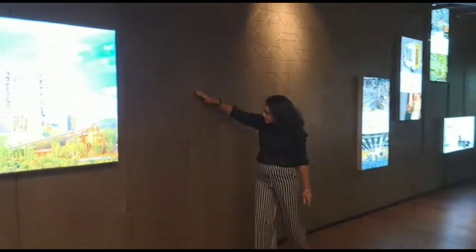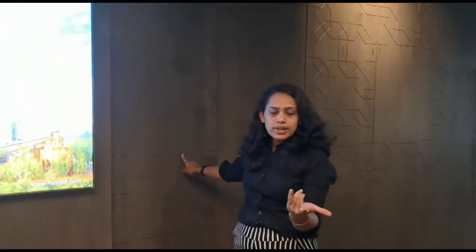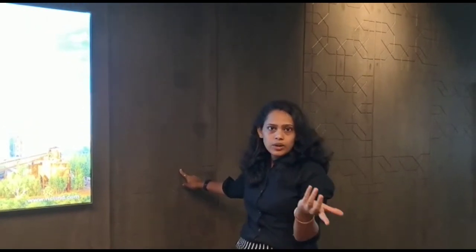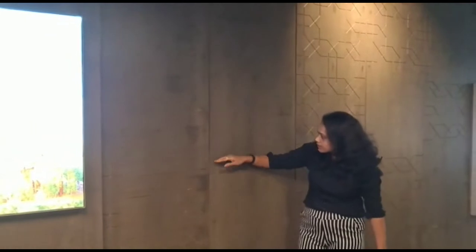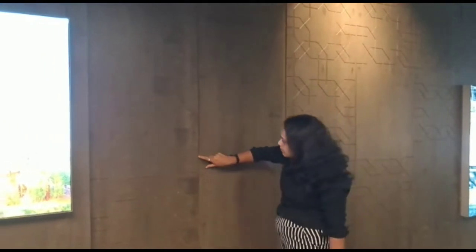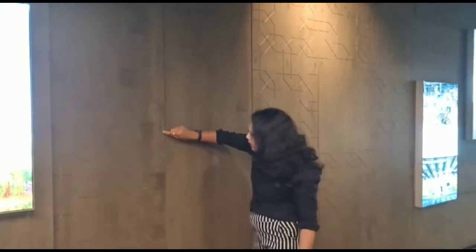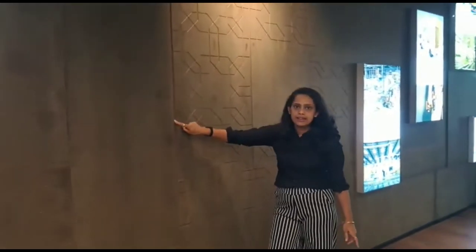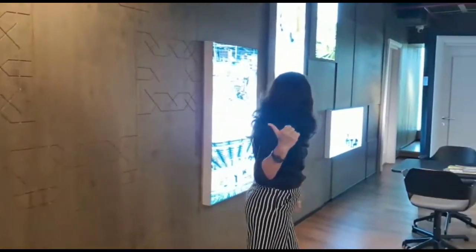Now, this is a wall panel. You can go for CNC cutting. Normally we have seen CNC cutting on plywood; here also you can go for CNC cutting, but grooving is required because sometimes there may be a little extension according to the weather. So grooving is required after each panel. Like that, beautiful designs you can make according to your choice.